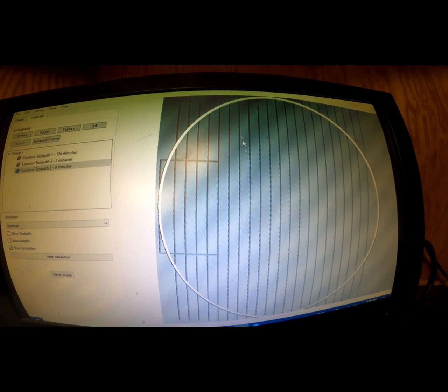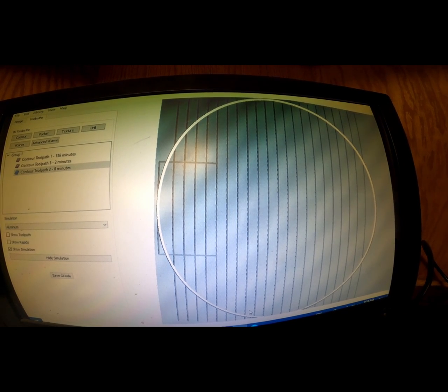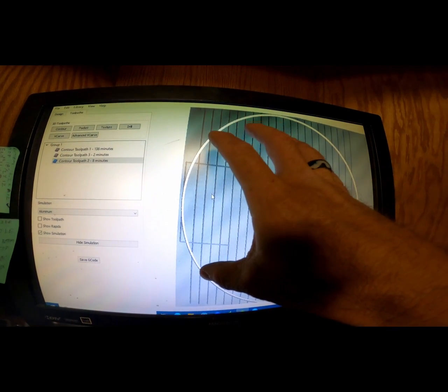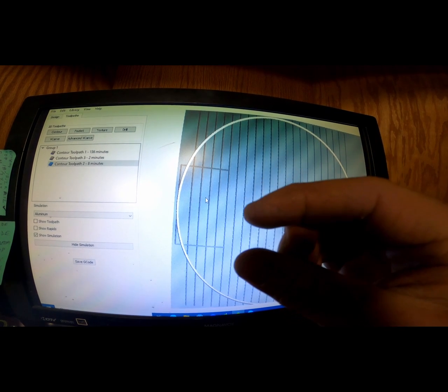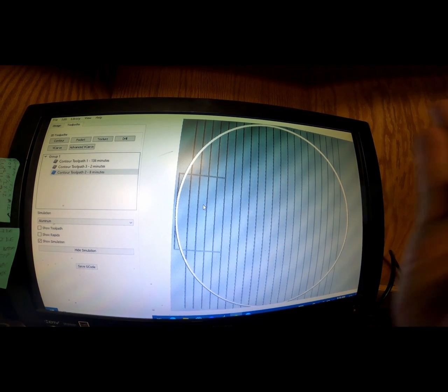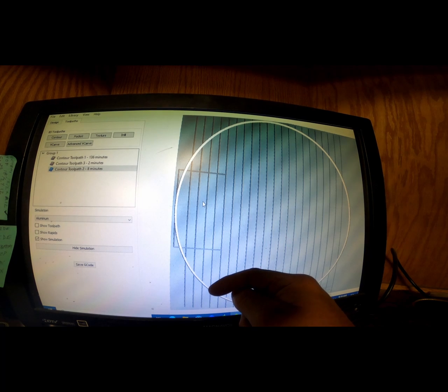So it'll cut all these grooves so I can drop all my 1/8 inch pieces in. My circle will sit around the outside of this. So essentially I'm going to drop my circle down over the top of this. I'm going to shim this up so it's 1.25 inches off the ground. So I'll be able to drop this over, drop all my pieces into this jig, and they'll line up with the outside of this circle.